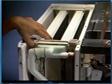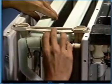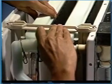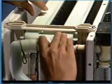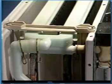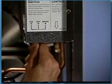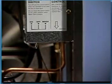Once the flat surface is clean, pull the distributor tubes out 3/8 of an inch to allow cleaner to flow down the evaporator ribs. When cleaning is completed, flush the water system thoroughly with clean, fresh water. Turn the control switch to the ice position. The ice maker will restart in the normal sequence of operation.